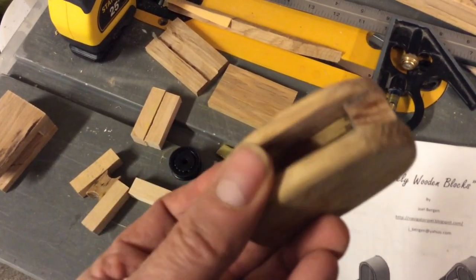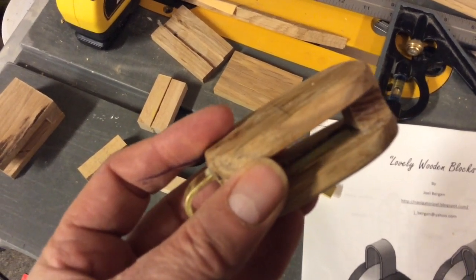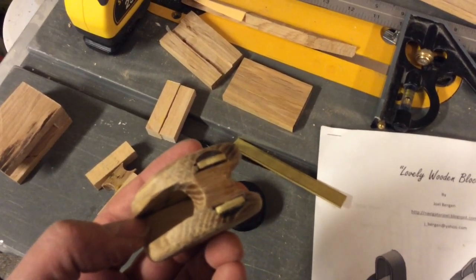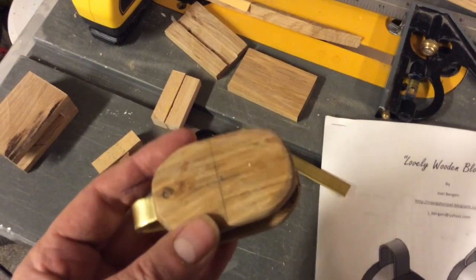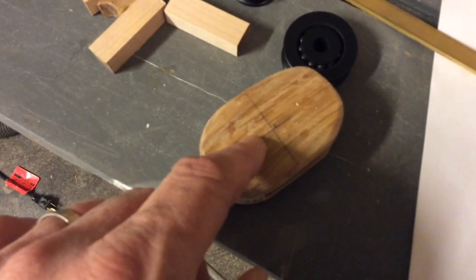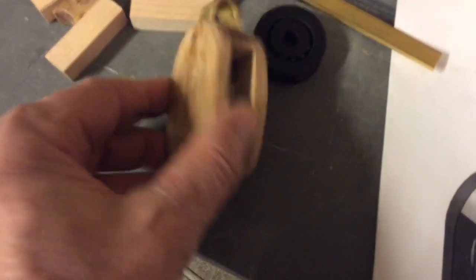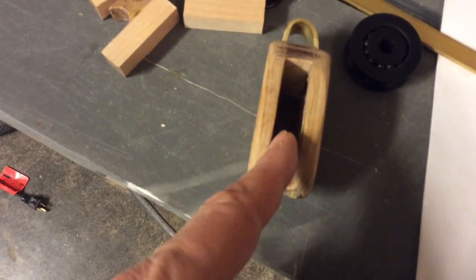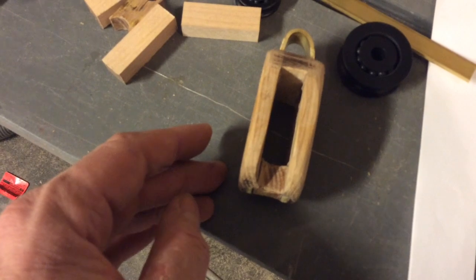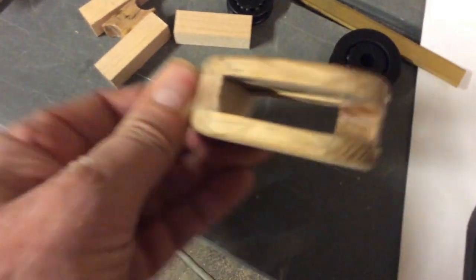You can see on the inside where the brass goes through — it's routed out so it's smooth on the inside and comes all the way down. I sanded all that off. The main thing left to do is drill the hole: you figure out where the center is, making sure you're drilling through the center of the strap. It's suggested to put a piece of block inside when you drill so you don't bend it, but I epoxied mine with thickened epoxy and glued the strap in tight so it won't come out.